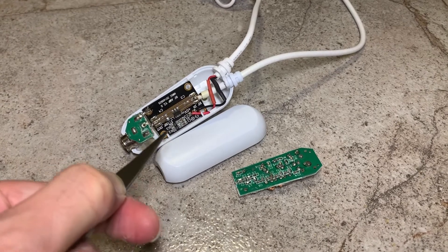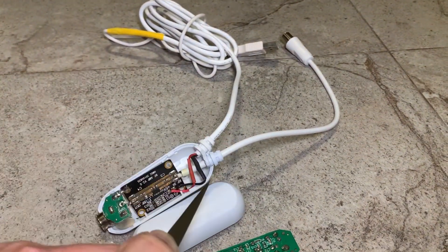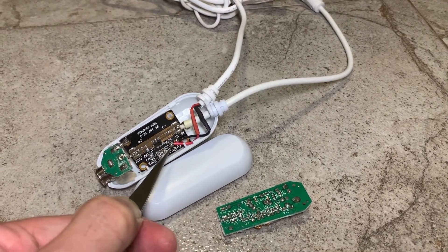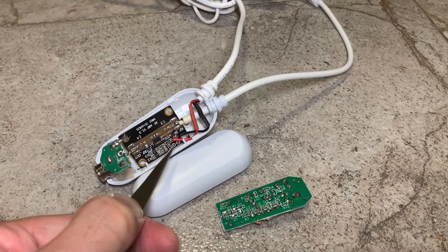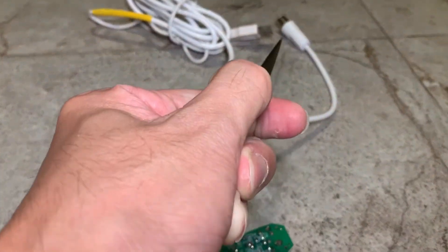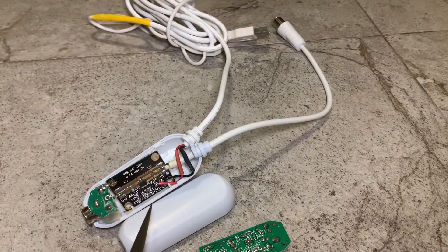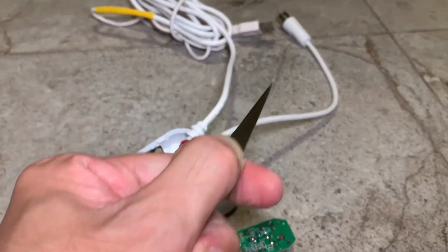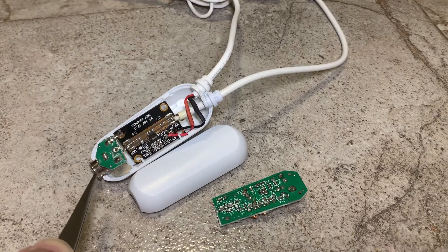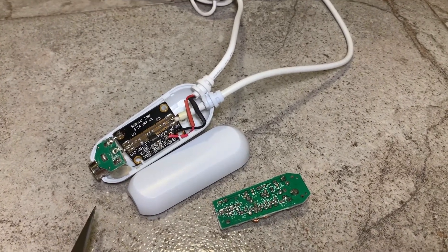It's all hooked up now. The USB-powered 5 volts goes into the LNA low noise amplifier input. You have RF in from here and RF out from here — the antenna will be plugged in there, and then the amplified signal will go into the FM radio through here. It's just a very simple project.